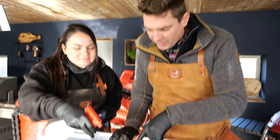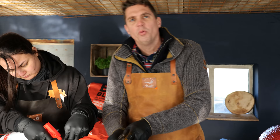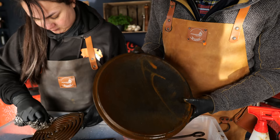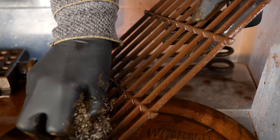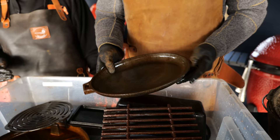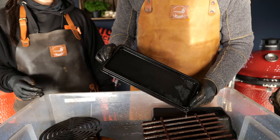We spray it a little bit and you can see the rust is disappearing and the metal is coming out. We can still see some dark rust spots on the edges and in the center, so we're going to do the same process again — spray it with vinegar, let it sit for another five minutes, and brush it down. We'll keep repeating that process until we have clear metal. Remember your 30 minutes — don't go over, otherwise you will have pitting. After rinsing, this one is already starting to look fantastic.